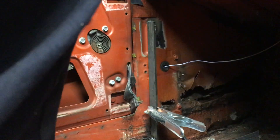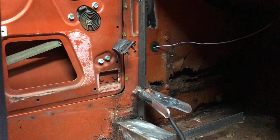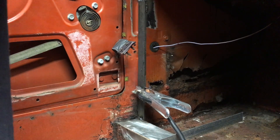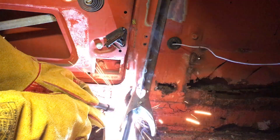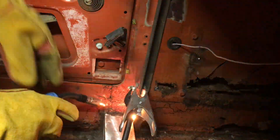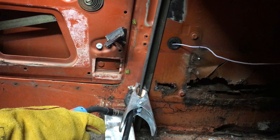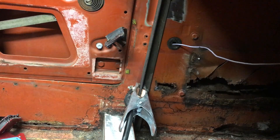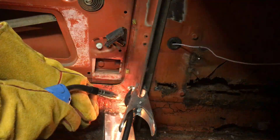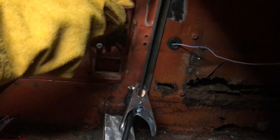Because I was keeping the engine in I had to make sure I was doing a good job getting the correct penetration of the welds so none of these crack and fail and cause the car to blow at all. I'm now seam welding in the bottom of that angle iron to the chassis member, so it keeps the height of the body and stuff like that when I chop out the structural components.